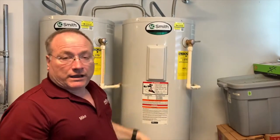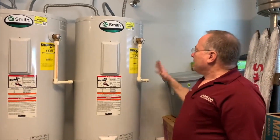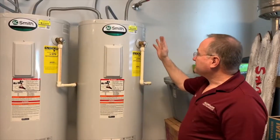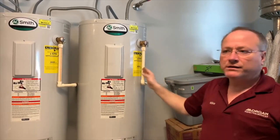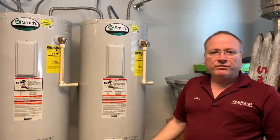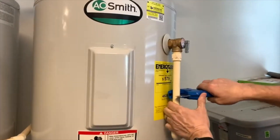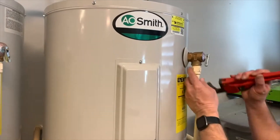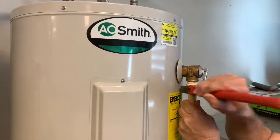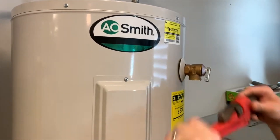The water heater has drained low enough where we can pull this relief valve out. Since this discharge line is going to prevent me from being able to unscrew the valve, I'm going to have to cut this line and put a coupling on it to reconnect it. Almost every relief valve on water heaters is a three-quarter inch pipe — it can be CPVC, PEX, or copper, but it has to be something rated for use with hot water. I'll cut the pipe, then take the discharge line out of the relief valve — it shouldn't be in there too tight. Then I've got to unscrew the relief valve itself.